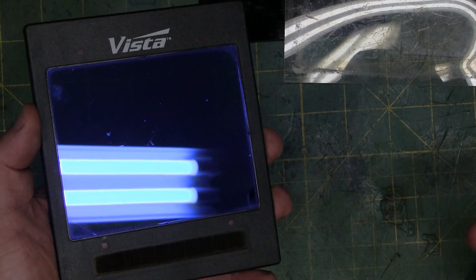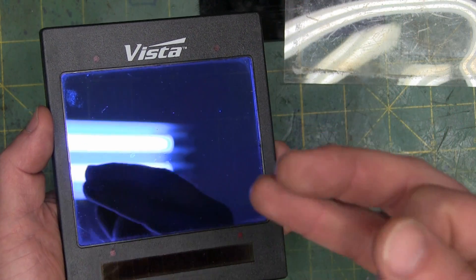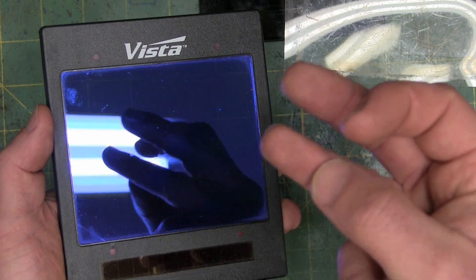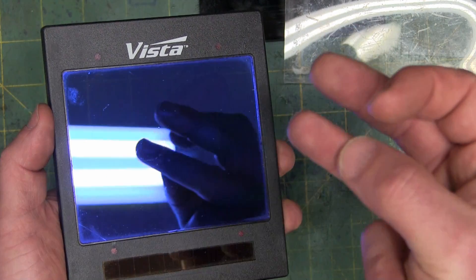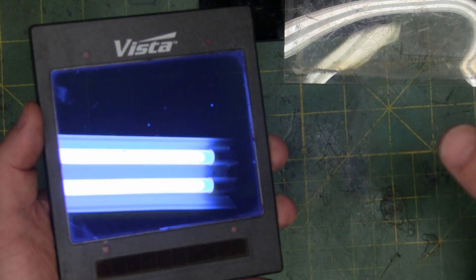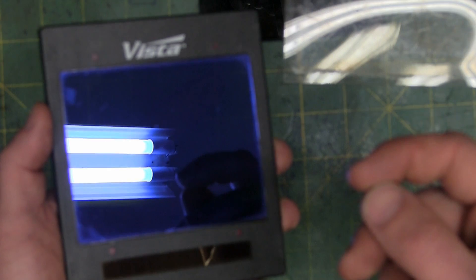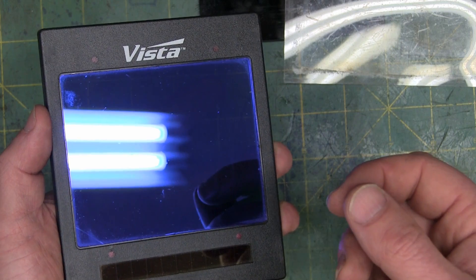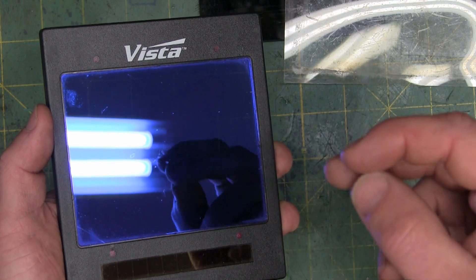You don't believe me? Turn on a radio next to a welder. So we've got UV — ultraviolet — which is what you think you're getting protection from. We also have IR, which is heat. Heat is very important to shield your eyes from. A welder who's been in the trade for a long time working at focal distance and running torches — infrared kills eyes. It cooks your eyes over time. So you need to wear proper safety glasses when running an oxyacetylene torch. It's not the UV that gets you, it's the heat rays coming off it.